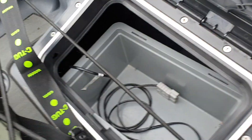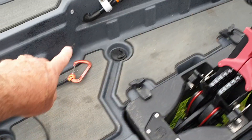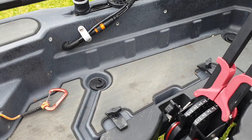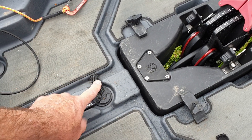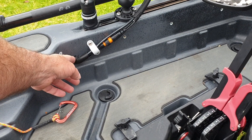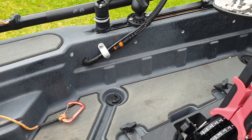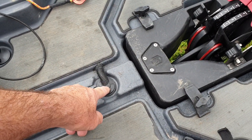This here is my power lead, which I had spliced in — it gives me plenty of lead and goes direct to my battery. I've actually fed this cabling up through the hull of the kayak. I was able to stick my head into this hole with a light and see where I was going. I brought the power lead up — here's your transducer cable and my power cables came out here. So I drilled this hole — that was a bit of a worry, but I had a really good look and checked everything out before I did. I used a coat hanger wire to actually get the cable from where I wanted all the way through and up to this hole here. So the power lead comes out here, the transducer cable is there, and this other cable I spliced in with a waterproof fitting in the hull — nice and neat. What I like is that I used the scupper hole cover.